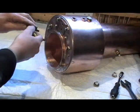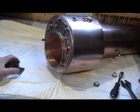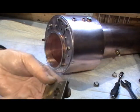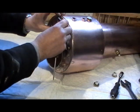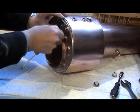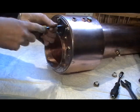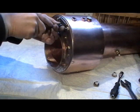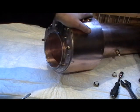I've just got my regulator pipe to seal off. I've made this plate and cut an o-ring groove in it. I dropped my screw — you always drop things on a garage floor and never find them, but I found it. I've put my o-ring in and I'm going to block that tube off now. That o-ring will just go around the circumference of that pipe and hopefully block it off. Just trying to put even pressure on the screw so it seats properly. Right, that's on.